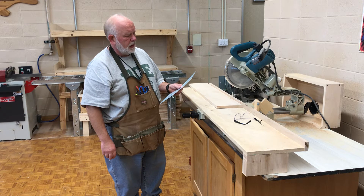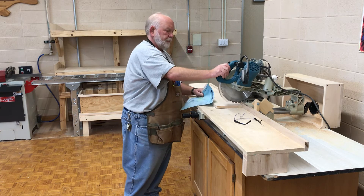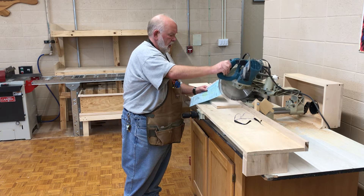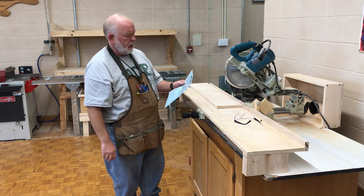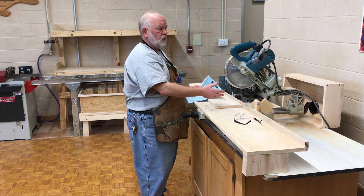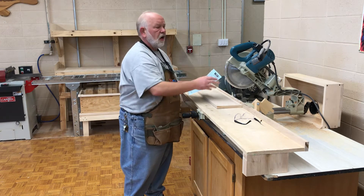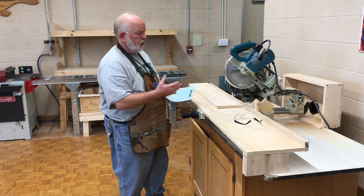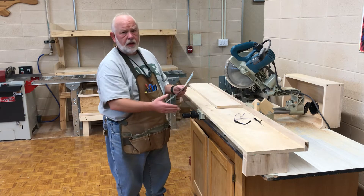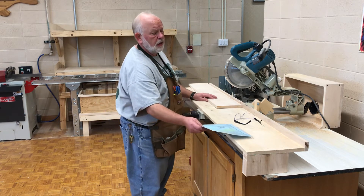Before finishing the cut, you've got to bring the saw through the cut and release the trigger before bringing it back up. We cut, hold the board down, then release the trigger before coming back up. We don't want the saw blade coming back up at full power because it can pick a scrap board up. Kerf — remember the table saw? Kerf is the thickness of the cut. If I don't set it on the correct line, I will lose an eighth of an inch because the saw blade cuts in a kerf.